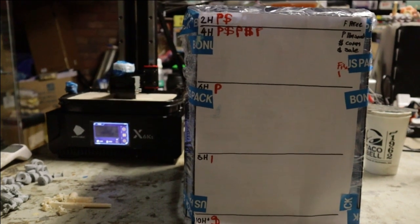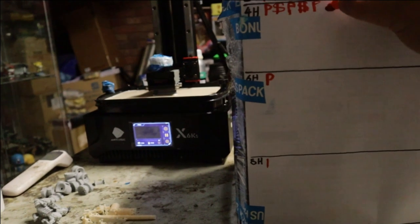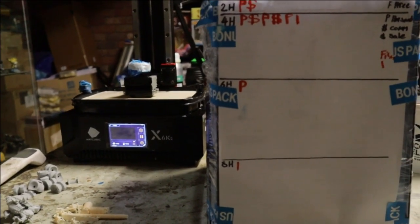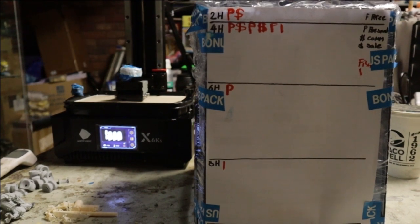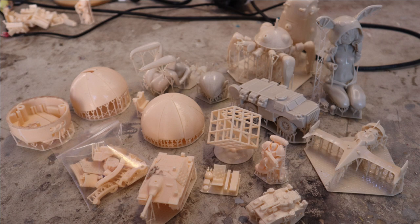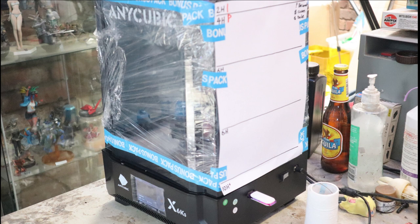With the steps followed in this video and extra tips from my experiences with continued commission printing and owning a third resin printer, the process is stress free and works in my business model of printing for profit. Over 50 hours running, I've produced a chart to track the life of this printer, which will be reviewed during the end-of-life review at a much later date. At approximately 5% of the life of the screen, I've definitely got my money's worth in prints produced. I always stress that if this is your first time, test a whole range of types and brands of resin and settle with what has the best results and adhesion. Also note: the thumb screws and UV shield are covered in plastic — a tip provided by Uncle Les — as you get a lot of sticky residue on your gloves which transfers to other surfaces.